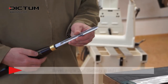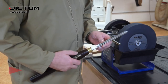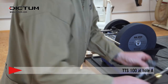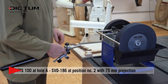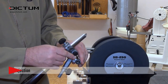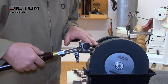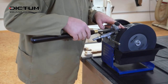Let's now go and look at how we sharpen these. Out of the packet, the factory grind on this tool is around 35 degrees. To sharpen the factory grind we're going to use the following recipe: on the Tormek, hole A on the TTS-100, and in the jig the SVD-186, we're going to put the tool on at a projection of 75 millimeters and a setting of number two. Starting in the middle of the wheel, roll it all over, use all the wheel when possible trying to keep an even shape, and soon you will have a sharp edge.